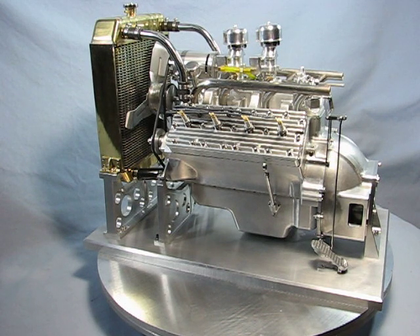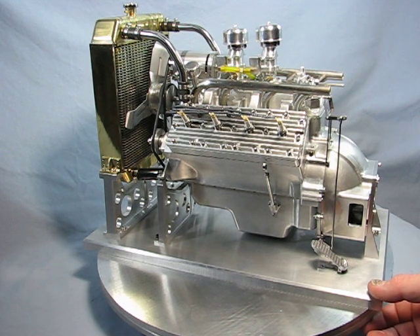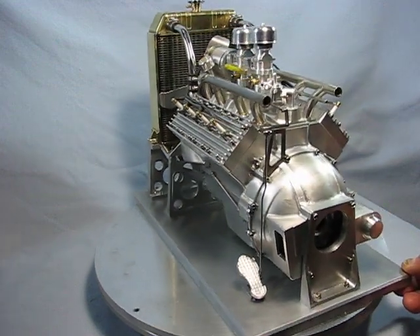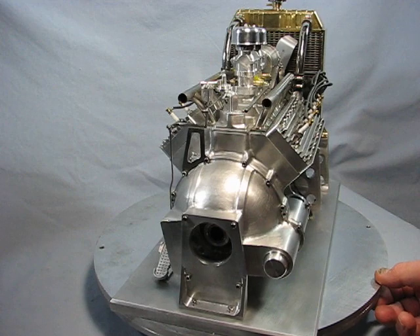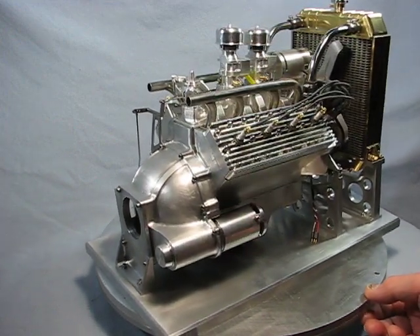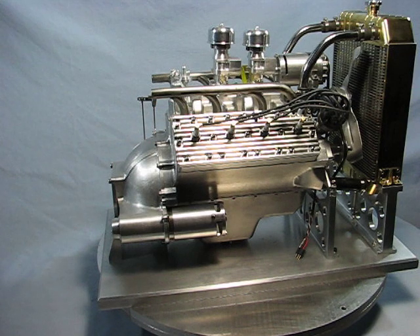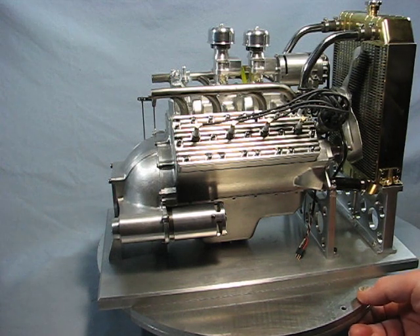This is my Fordelac V8 engine — it's approximately one-third scale and was built to replicate a late model Ford flathead, with the exception that the exhaust comes out the top, which was patterned after a Cadillac. The reason for that is when trying to fabricate it from solid stock, it was too hard to get the exhaust runners through the water jacket and out the side of the block. The engine has a full pressure oil system driven by the oil pump, much the same way as the full-size Ford flathead, by helical gears in the back of the block.